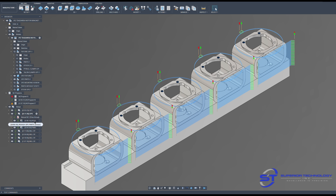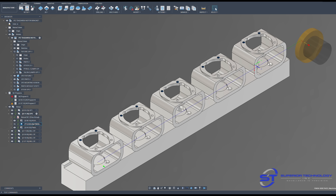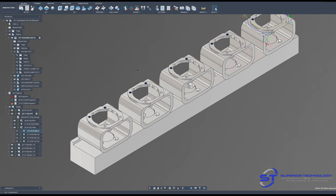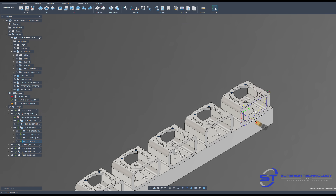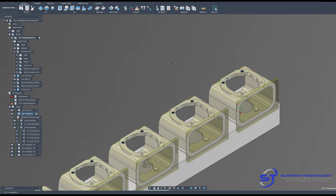Here you'll see OP2 using the same one-inch feed mill to rough the tops off, rough all the material off the side, finish cut, and then milling the boss on top of the parts and adding some nice edge breaks. There's the 3/8-inch end mill, there's my chamfer mill putting chamfers on all the parts — and that means complete parts off the machine, no burr.